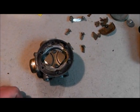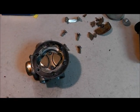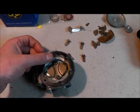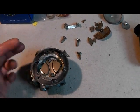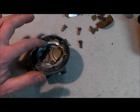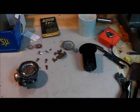A word of caution about silicone sealants — someone at some time had this pump apart and resealed it with the usual clear silicone sealer. It's all oozed into the inside, and it's obviously affected by fuel, so I'm sure there's been bits of that floating around the fuel system. We'll clean all that out.